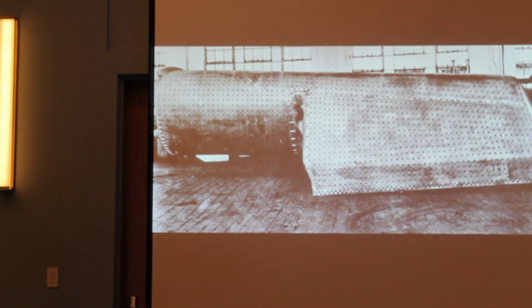Then heat treatment, what's called post-weld heat treatment. After you weld something, depending on what the material is and what the application is, you want to do a post-weld heat treatment. In other words, you're going to put the whole thing in a furnace, heat it up to roughly 1,500 degrees for a minimum of 1 hour. The typical rule of thumb is for each inch of material thickness, you want 1 hour. So if it's 3 inches thick, it's in there for 3 hours at 1,500 degrees. You ramp it up slowly, you hold it for the time you need to hold it, and you ramp it down. This relaxes everything.